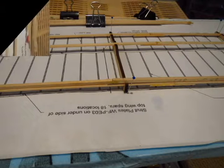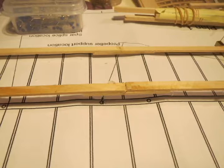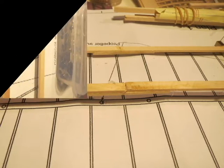UV activated plastic was also found to be a very useful joining technique. While holding a part in one hand, just shine the UV light for 10 to 15 seconds to set the adhesive. A reinforcement wood strip was epoxied under each wing fixture splice for added strength. The finished wing fixture is ready to accept the 2 main wing spars.